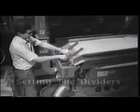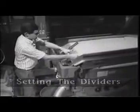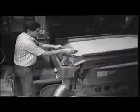Setting the dividers to divide between heavy, medium heavy, and the light product is another adjustment. Seed conditioners often ask where to place the dividers. There is no general answer to this question. It primarily depends on where the undesirable product is being discharged off the deck. Incidentally, the medium-heavy product is a blend of good and bad, so many conditioners recycle this product to salvage the good. Now that we have discussed the effect of various adjustments, let us talk about how to set the machine.